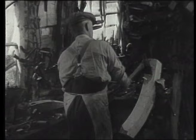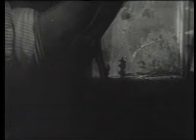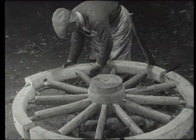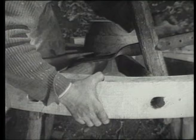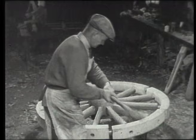Now they must be chopped down to the final size. The seasoning of wood is important in wheel making — a year for each inch of thickness is a rough and ready rule. The fixing of the fellies is called wringing the wheel. And this tool, which we call a spoke dog, strains two spokes together while the felly is slipped on.